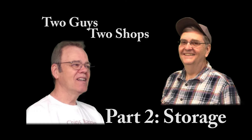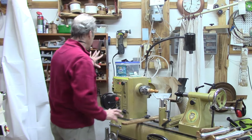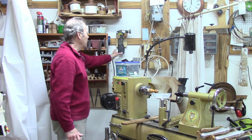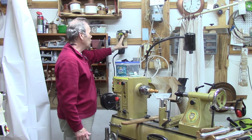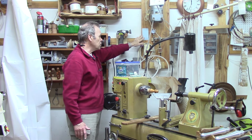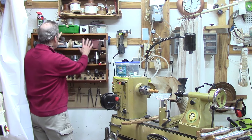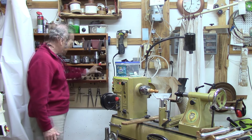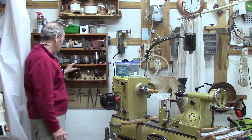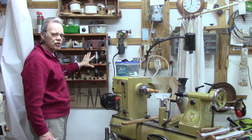So let's get started. Let's talk a little bit about tool storage for woodturning, although a lot of things will also apply to flat work. I like everything very convenient within reach, so I've got a place to put my angle drill for sanding on the wall. I use a French cleat system. My vacuum pump hangs on the wall on a French cleat system, but one of the handiest things I've made is this little storage unit that hangs on a French cleat system where everything I use for woodturning — awls, drive centers, screwdriver, pair of pliers, any number of small things — I can just reach out and grab them.